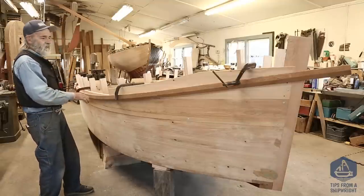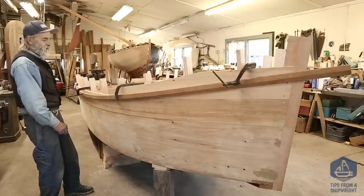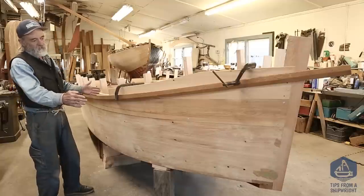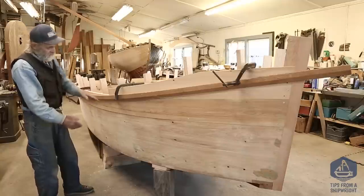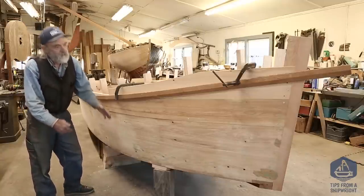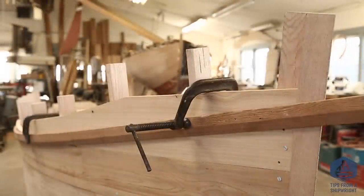The material used to build the boat dictated to us what we had to do, and the rest of it I just kind of conceived and stretched that batten around there and clamped it on. I think it looks great just like that. Some of the shape of the side of the boat was designed way back when I struck the angle on the plank and on the expansion when I fit the sides of the plank together. We're still designing the boat - this is the latest in our design work right here, arriving at the shear line.